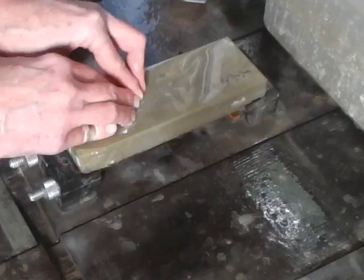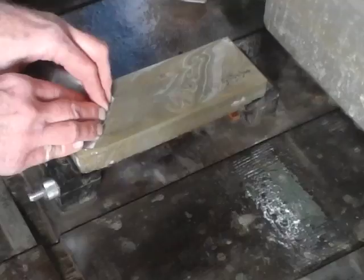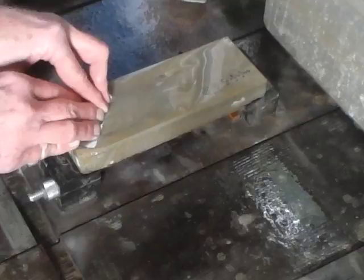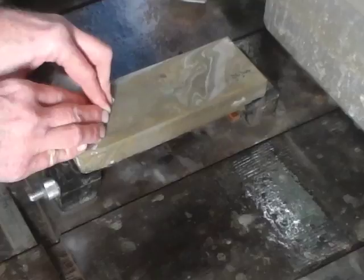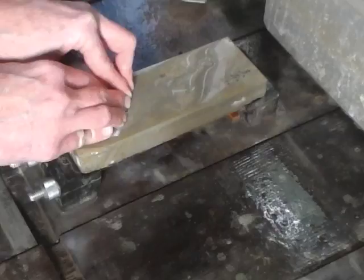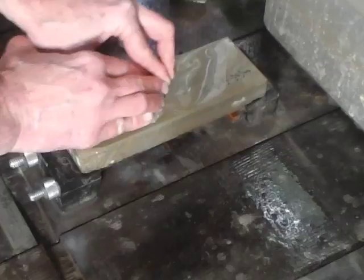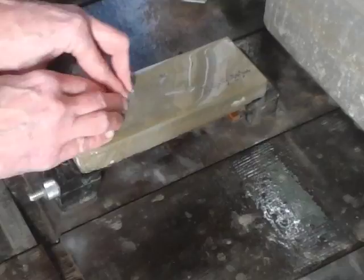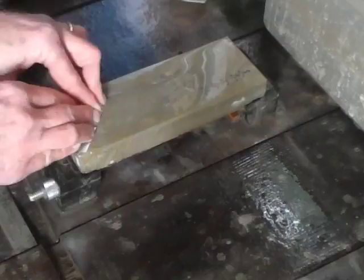It's going to get a little jumpy because there's some suction developing between the stone and the steel — if that happens you can go backwards a little bit and continue the stroke. The slurry isn't truly lubrication, but it does add flexibility and ease of use. When you have a slurry on the stone, the blade doesn't get sucked in so deeply and you get a smoother stroke. You can try to work a little bit faster too, but towards the very end you want that really tight relationship between stone and steel.